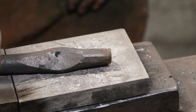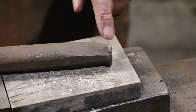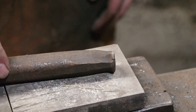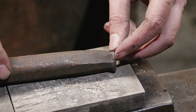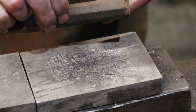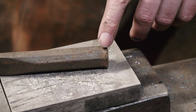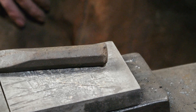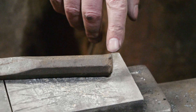Everything's looking okay with that. As you work on it, it's going to start looking like this — you can see that end is starting to come out, hang over, starting to mushroom. This is where it starts being a danger. You start getting cracks in there, these little pieces start flying off. This one has actually had some pieces of it start flying off, and that head is really starting to mushroom out. This needs to be fixed and addressed.